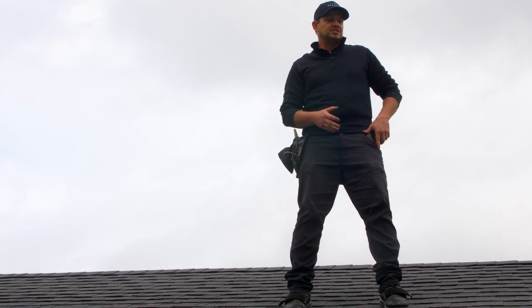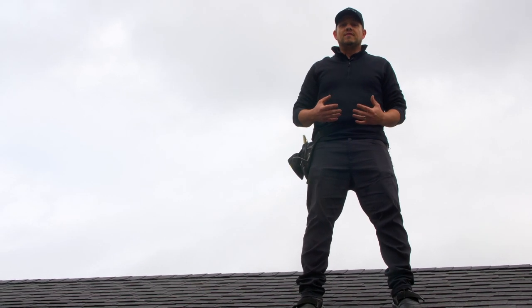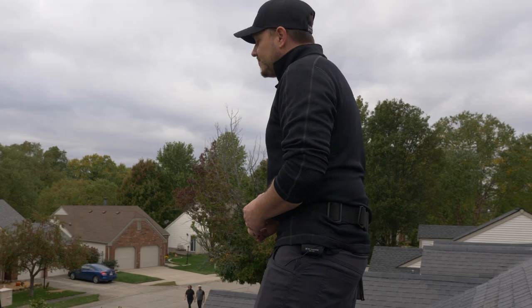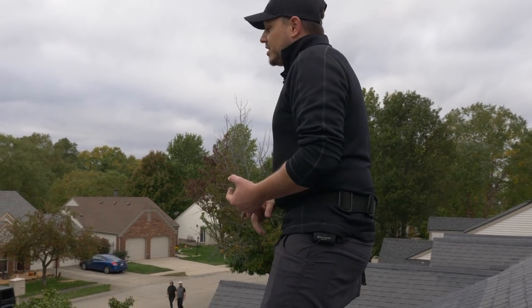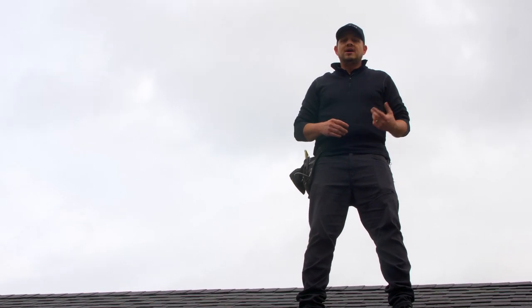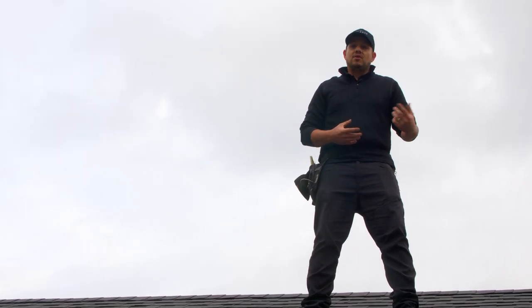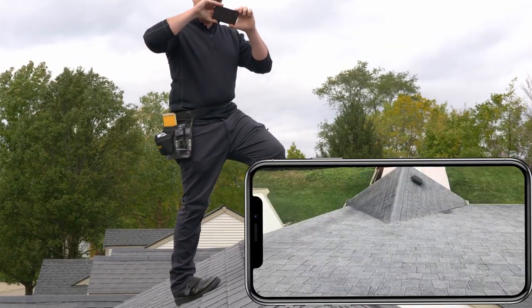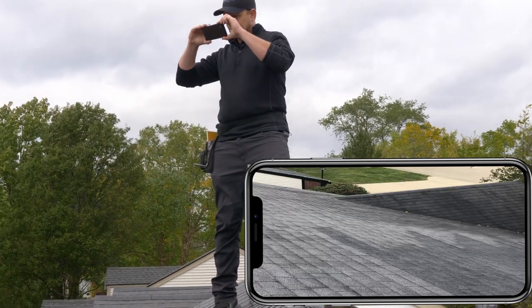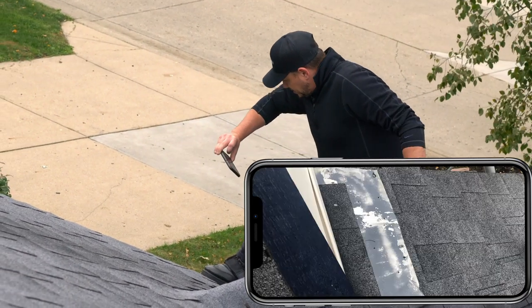Now that we're topside, the main focus first is to stand up at the ridge and try to get a 360-degree view of the roof so I can count components and see how everything's laid out. From there I'll be looking at all the different components, looking for tar, nails, any caulking — anything that will interfere with tearing this roof off. I'll take my far-offs and close-ups just like we did on the elevations. It should all work like a flipbook by the time you've seen the full walkthrough.